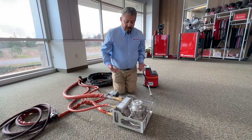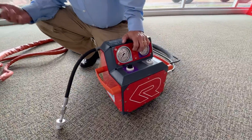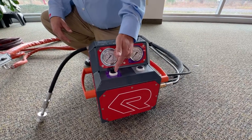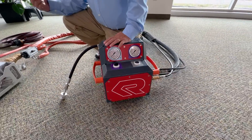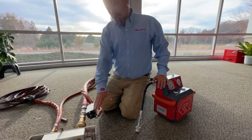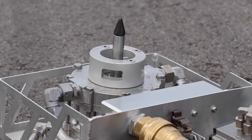Once in position, slide the unit under the vehicle. With the unit under the vehicle and water pressure established, activate the system. Activation can be a little loud, so make sure personnel are in the safe zone where the control unit is located. Then give a clear three-two-one countdown so everybody knows what's happening, and simply turning the valve will activate the system — puncturing into the battery pack and flowing water immediately. After firing, the quick valve opens, allowing the large air reservoir to rush into the system, pushing the penetrating nozzle up with 600 PSI of force.